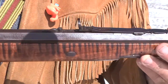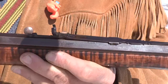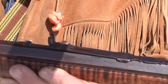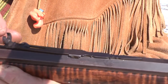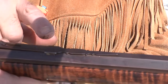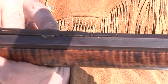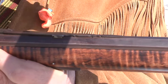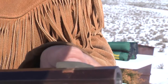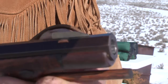This particular rifle is fitted with an adjustable type sight that would have probably been on it later in the history of this rifle. When I say it's adjustable, it has a little ladder in there that you can make the rear sight go up or down depending on which way you need your ball to go. Up and down is called elevation; side to side is called windage. Most of these old guns, windage is not adjusted with a ladder or a screw — it is adjusted by tapping the sight right or left in the dovetail to get the ball to go the direction you want. The front sight on this one is also in a dovetail. If you need the ball to go up and down, you'd have to raise or lower it, which is kind of hard to do.